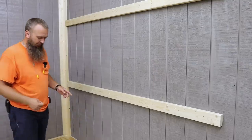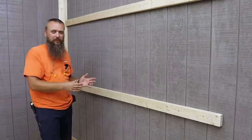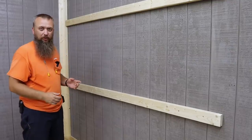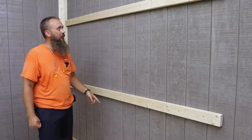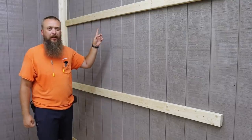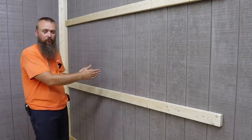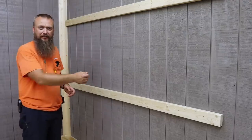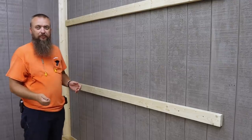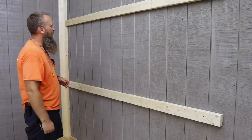Now the base is pretty much done right here. I did put a scrap piece of poplar on the front of this, kind of like a toe kick. That way if I got boards and I'm looking through them, it will keep them from sliding off, hopefully. The next thing we need to do is work on these two 2x4s. I got one at 3 foot and one at 6 foot up from this base. And on these, we're going to have our black pipe come out with chains, which will stabilize the wood in different areas, make like little rows or different sections rather for like cherry and maple, walnut, and so on. And I'll put chains connecting those as a safety feature just so they don't come forward and fall over one day. I think it's gonna look pretty good, guys.